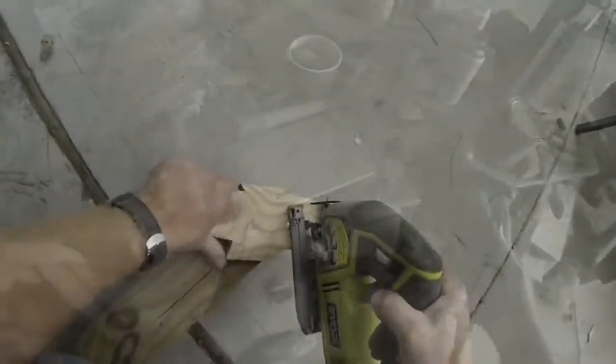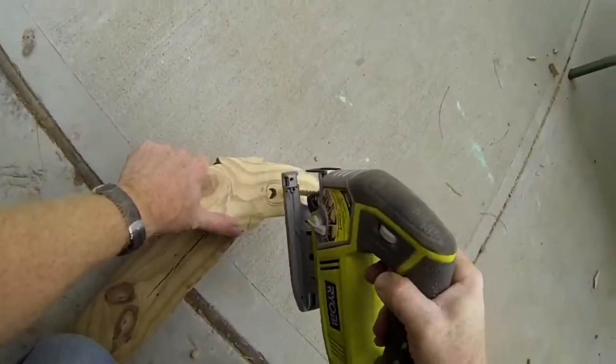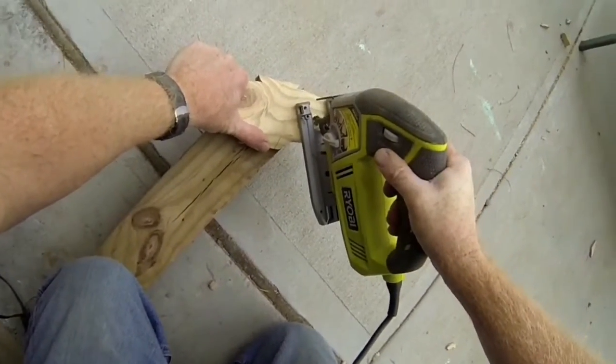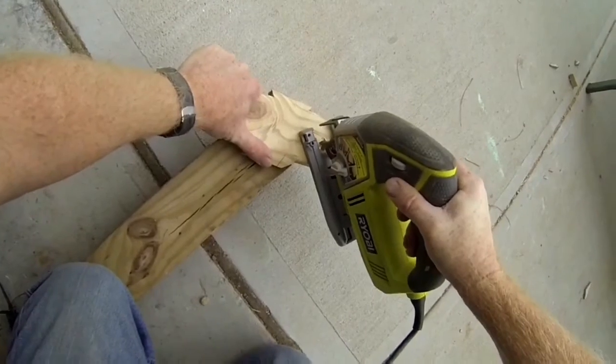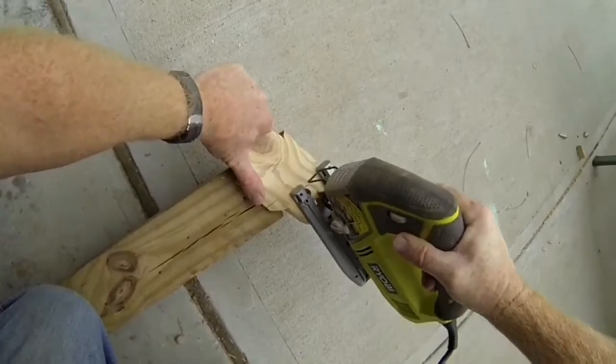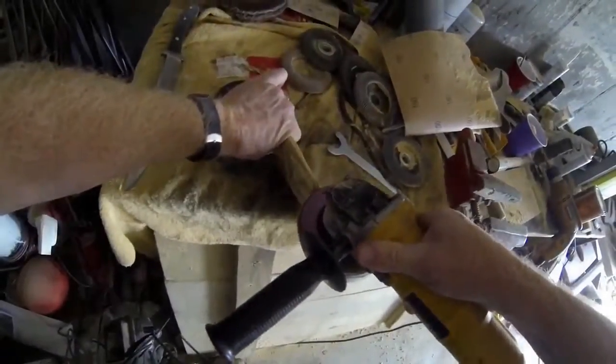Once you get the basic thickness of the fish to the desired size, I'm going to use a drill to drill a couple of holes for the eye, and then a jigsaw to actually cut out that oval. The eye has to be an elongated circle or an oval so that it holds the wine bottle neck correctly, so that the wine bottle really sits parallel to the table.